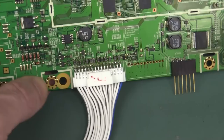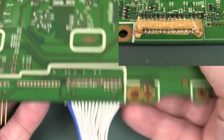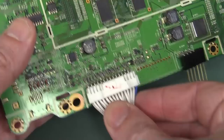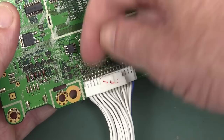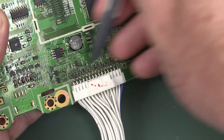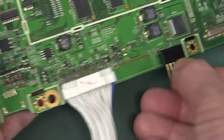But this dual-row connector was beyond salvaging — all the pins were at the wrong angle and everything. So David chipped away at all the plastic, basically extracted all the individual pins, and then we manually re-soldered them. We cut away all the plastic and manually inserted each pin back into the connector, put it back into the board, and re-soldered. With the dual-row nature and one millimetre pin pitch, that was all very tricky business.